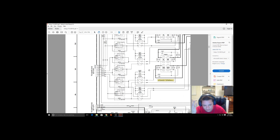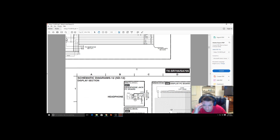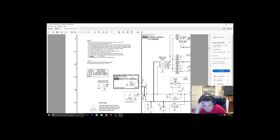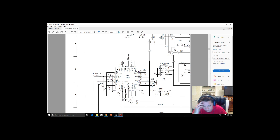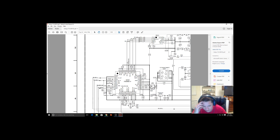There's just no power going to the amplifier board. Something here needs to be confirmed or powered on, and then it'll power on the amps. It does however switch relays when you click over different modes — the relays click — but just no sound and the display is just sporadic randomness. The power board has no problems; I'm getting all the power from each rail that I'm supposed to. Not sure what's going on with the DC PC board either — I don't think there's any problems there.